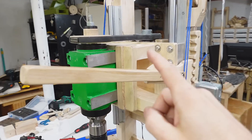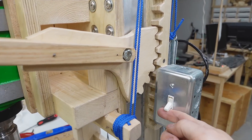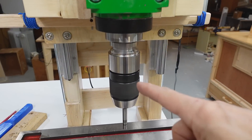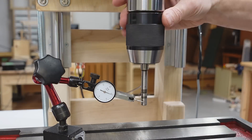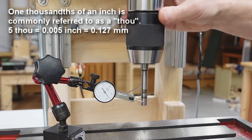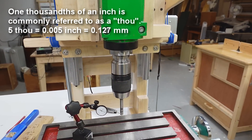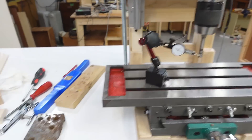Since my last video, I put some varnish on the wood because if I touch it with greasy fingers, that really discolours it, and added an electrical switch to it. I've been using it with this chuck here, which for a drill press actually runs pretty true. But for milling, I imagine you'd probably want a little bit better than that — that's in thou, so five thou worth of wobble. The other problem is it's a Jacobs chuck and it sticks out way too far, so not ideal for milling.